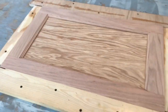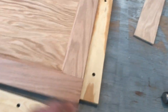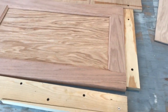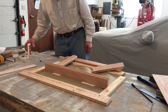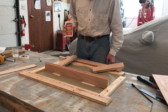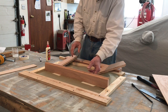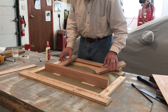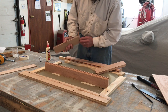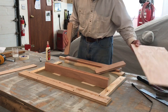This is in here loose — I have not glued it up yet. So we'll set the camera on a tripod here and see if we can't glue up this door. We're going to take this Titebond wood glue and glue up a door. We're not going to put glue on the stiles — what we're going to do is glue up the ends of the rails and put them into position, and then put the panel in after that.